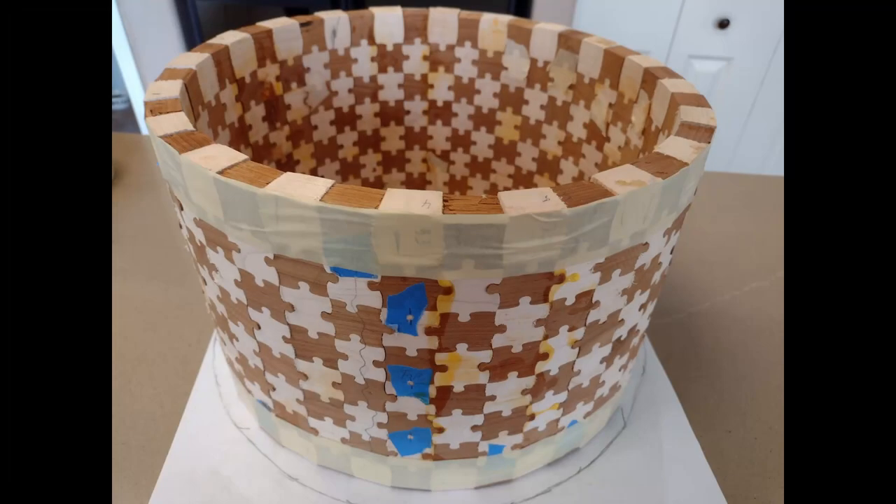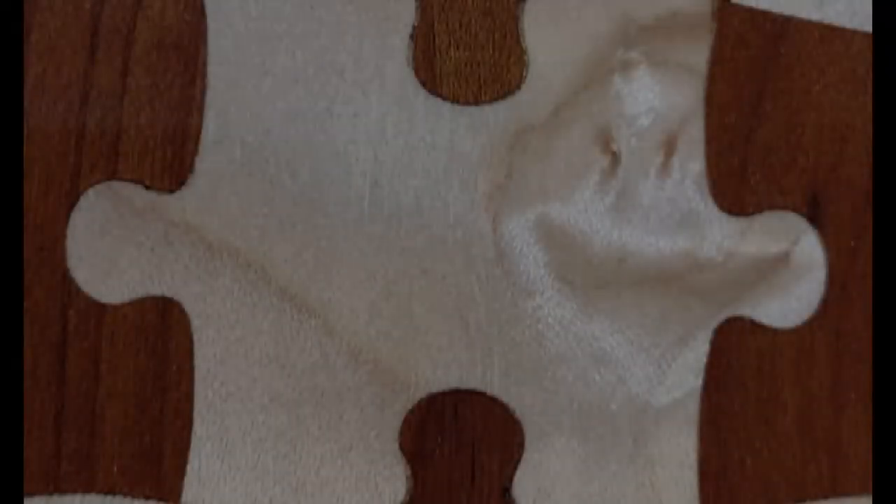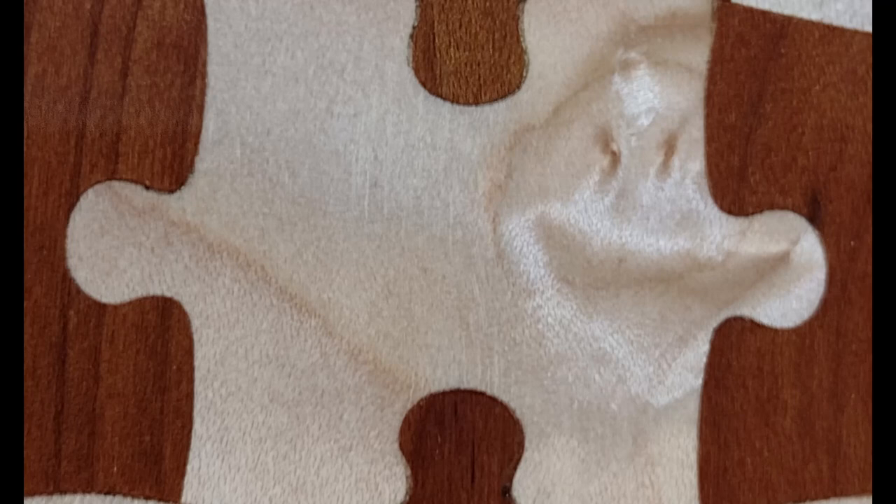The video is already over 18 minutes and this is a good stopping point. I finished cutting all those staves — the exact same process as we already saw — and now I've done a dry fit. This is not glued up, just getting the round shape, measuring, making sure it's good and I'm happy with the shape and size and width of the drum. The next steps will be to glue it up, make sure it's perfectly round, then take it to the rotary CNC and skim the outside and inside, and then add some finish to it and see how it comes out. When I was finishing the drum, there was this little face I kept seeing as I kept spinning it — I kind of decided it looks like Curious George to me, but please add it to the comments and let me know what you think it looks like.